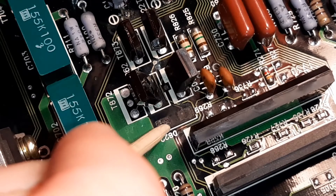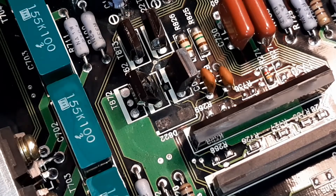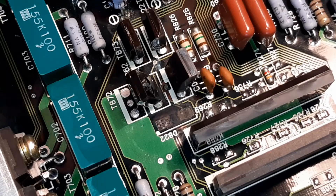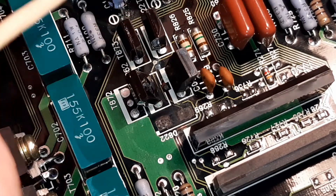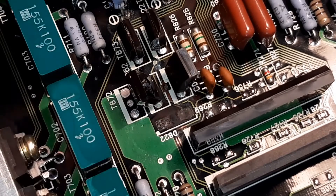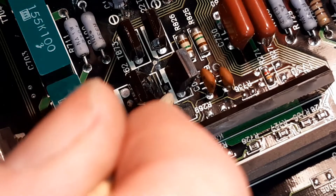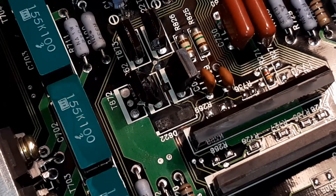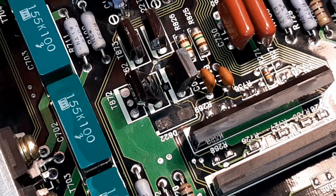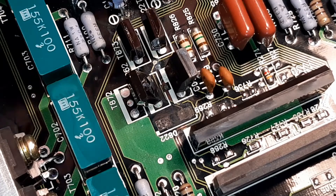Then I'll see if I can find a way to reattach the soldering pads again to the circuit board — maybe scrape off some material, get to the bare copper trace, and try to get these pads back on. This is some severe damage I didn't notice, but probably that compound that wore off the lead of the original diode has corroded into these pads and also into this lead and the lines there. So it's pretty severe damage.